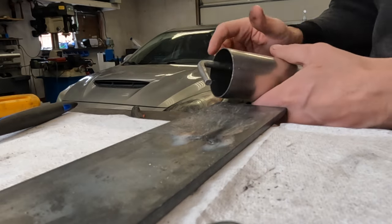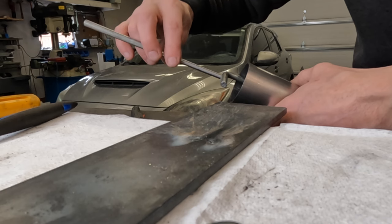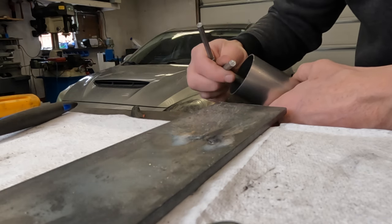I was trying to figure out how I was going to weld this to the rotating piece accurately enough so that it would actually work. I put it together and it didn't work out very well — it was very sticky, I couldn't turn it by hand, I couldn't even turn it by drill most of the time. So I ended up setting it up in the lathe and trying to true it with a dial indicator, and then I decided to cut it back apart. I've got the part that will go through the exchanger in the drill chuck and the other piece held in the lathe chuck, and I'm going to weld it here while it is in the chuck.